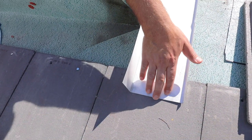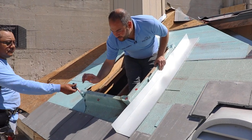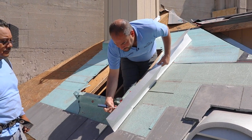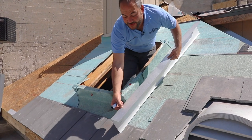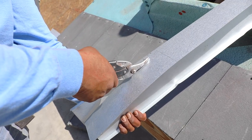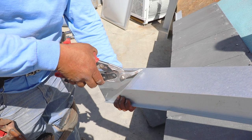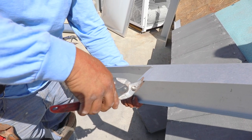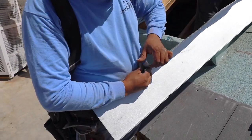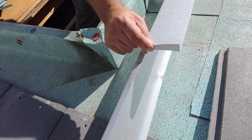So this is 3 inches right here, so that our tile is going to cover over it. We're not going to see the bottom of this tile pan; however, we're going to achieve the water coming back on top of this tile. I'm going to hold this in place and mark out this line. Then we want to cut it a half inch — essentially the same lip that we have here — in order to make sure the water gets diverted to where we want it to go. You can see what Marco's done here is leave a half-inch to one-inch lip that we're going to bend over, and that's going to tie in perfectly with our flashing on the head wall.